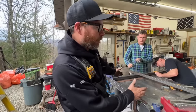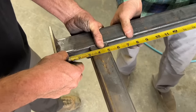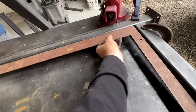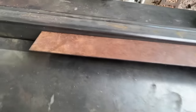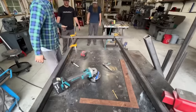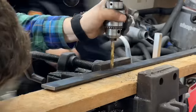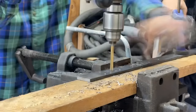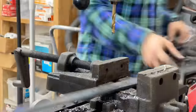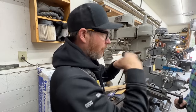We are to the point where we're going to assemble these frames. As opposed to woodworking, we have to clamp everything in position, make sure it's square, then tack it — clamped to a metal table, of course, since a wood table might catch fire. Jamie's going to zap it all together. Jamie had the idea that even though the half-inch pieces are square, we're going to drill a round hole big enough for them to go right through, then weld it up.